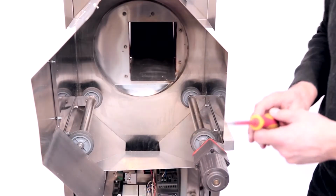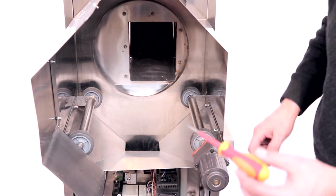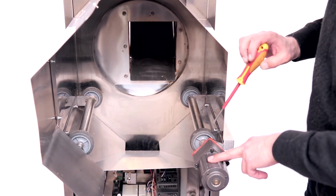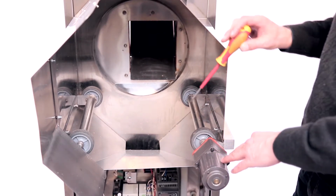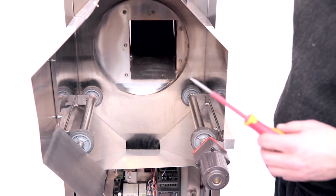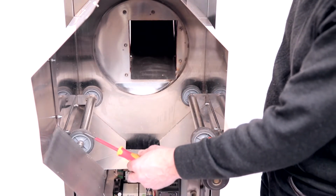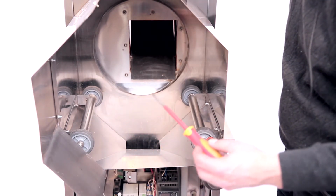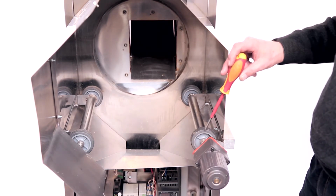Sifter is 4 rollers supported, 2 of which are driven, 2 others are driving. The motor is connected to driving rollers shaft with a clutch. In case the sifter does not rotate, you need to check the cleanness of rollers, to check the absence of wear and tear, to check integrity of shaft's bearings, to check the bolts operability that connect shaft with clutch, to check operability of the motor itself.